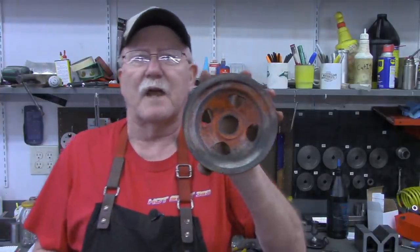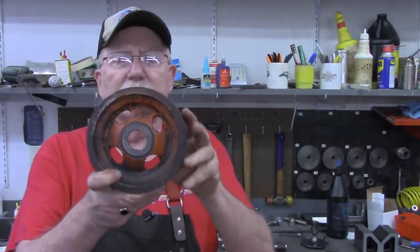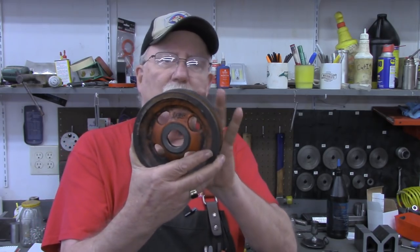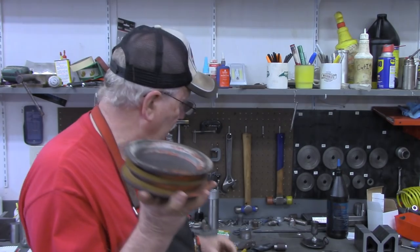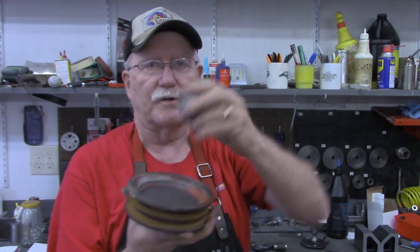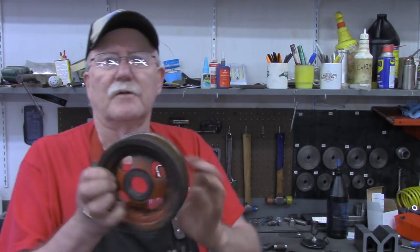What I'm going to use for the bottom is actually an old pulley that I found in literally a trash pile. It's been bored out to some non-nominal value and it had a long spindle shaft that's been cut off. The first thing we'll need to do is make a plug for that. This is concave in the middle, but I'll need something to push down on that piece of metal once it's in there. I'm going to use another piece of scrap that will set in there, and on the 20-ton press we'll push it. This has got to be machined down to size.